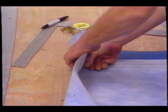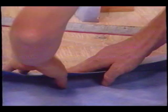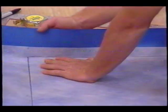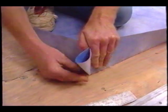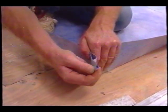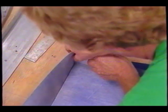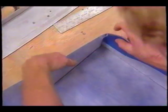Pre-folding this material produces flat, even surfaces. NobleSeal TS is a 3-ply membrane used for thinset work, and it is designed to allow the tiles to move independently of the substrate. The CPE stands for chlorinated polyethylene, and it forms the central core. To each face of the CPE is bonded a mat of spun polyester fibers. These fibers grip into the thinset and allow tiles to be set on the membrane and the membrane to be bonded to the substrate.